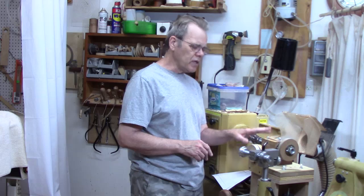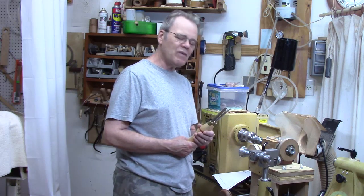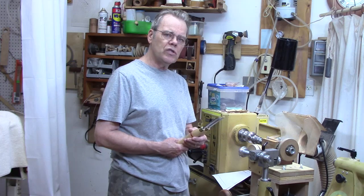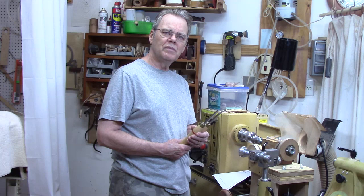Details on actually using this jig are outside the scope of this video — maybe we can defer that if there's interest; please leave a comment below. If you can't afford to buy or make one, you still have the option of buying a set of hand thread chasers. I'd buy the 16-threads-per-inch set — it's the easiest to learn and the best general-purpose size. I really enjoy hand thread chasing and find it very satisfying, more so than using a jig. A shoutout to Sam Angelo, the Wyoming Woodturner, for all his hand thread chasing videos that helped me. Y'all stay safe and come back.